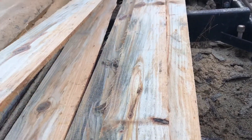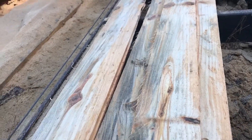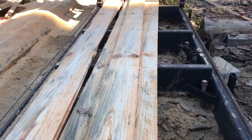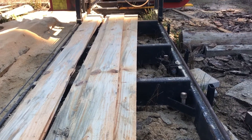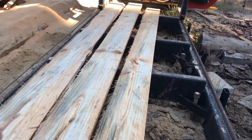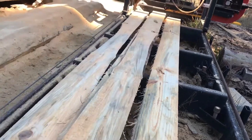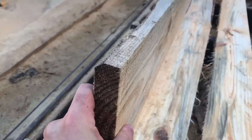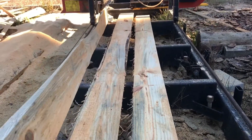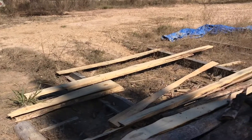Well, twenty-four, thirty — that one's got some wane in it. Anyway, for what I'm using this for, basically in place of OSB — I don't know what a sheet of half-inch OSB costs, maybe 20 bucks, maybe 13 or 14 — it's not a huge money maker here. But for me, running this mill a lot of times is about just not having to go to town and buy stuff. This piece will work fine for sheathing. And here's my scrap board I was telling you about — that odd thickness, about an inch thick. That really is scrap, and I planned it that way. When I first started running this mill, I'd often end up with a perfectly square board on the bottom that was too thick for what I wanted.